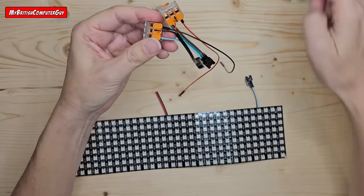Okay, so next thing we need to do is hook this up to our ESP32. So you take the female side of the breadboard jumpers and plug them into the respective pins. So the pins we're interested in are the 5 volt pin, the ground pin, and pin 16. So we identified pin 16 over here, so let's go ahead and do that one real quick.